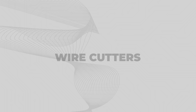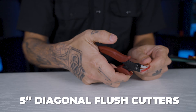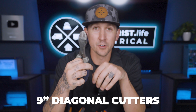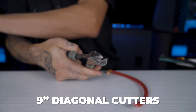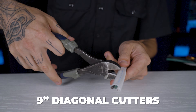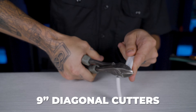Wire cutters. I've got three types of wire cutters that I use for cutting different sizes and types of wire. Five-inch diagonal flush cutters — I use these for wires 10 gauge and smaller, as well as working in tight spaces. Nine-inch diagonal cutters — I use these for wires 6 gauge and smaller, as well as multi-conductor wires 10 gauge and smaller, for example 10-2 with a ground Romex or 12-3 stranded.